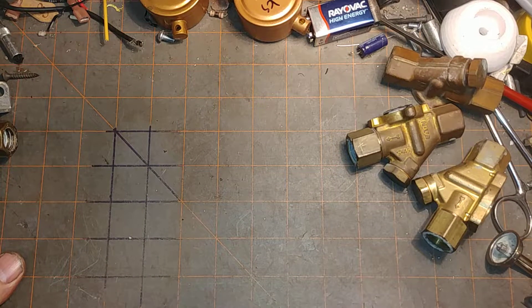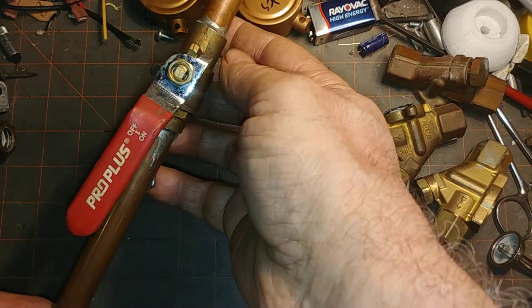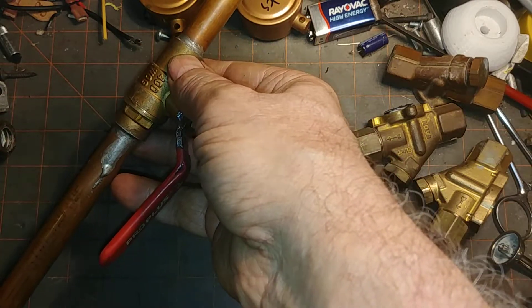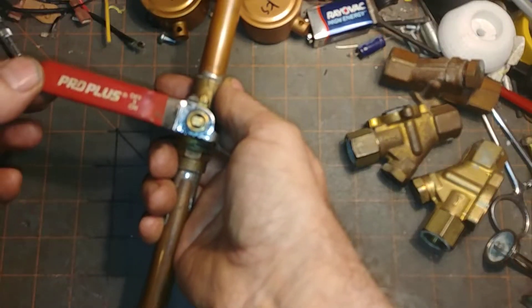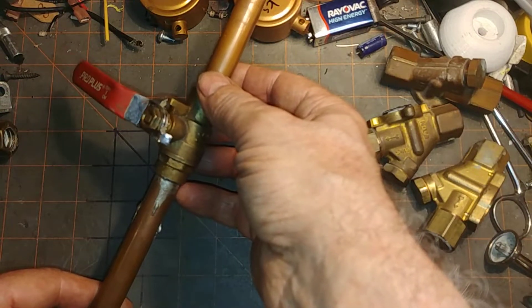Then there are those who say, 'I don't even have an automatic feeder — why am I still getting too much water in my boiler?' That's when you start thinking that maybe the shutoff valve is the culprit. Sometimes you might leave it just partly cracked, or you might have a hand wheel type that's been passing water slowly over the summer.